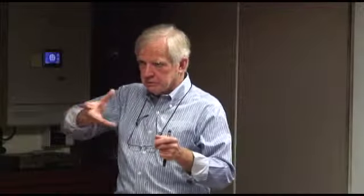I'm used to doing things with a ruler or whatever. Oh, I use rulers. You whip one out and measure and then go back? I use calipers. But when making a fit like this, you just make one end. And then while you're making the other end, you get it closed and then just try to put them together. You take a tiny bit more off and put them together and it doesn't quite go yet. You take a tiny bit more off, and it's trial and error, over and over again.